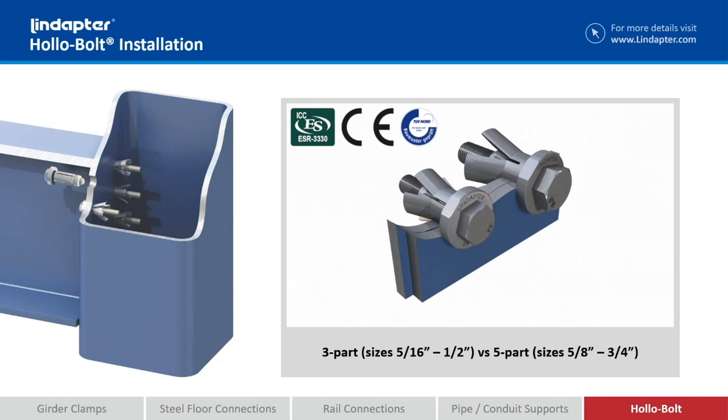Right there directly behind the base material, there might be a little bit of — for lack of a better word — slop in that connection. Then when you go to load it up, the thing sort of settles into place. What the rubber washer does is it compresses during the installation process, thereby putting a higher axial — or compression — force on that connection. That's why we call our little rubber washer the high clamping force mechanism.